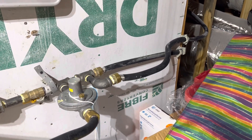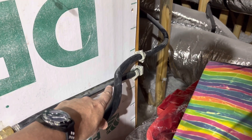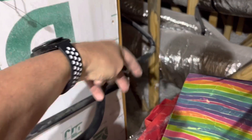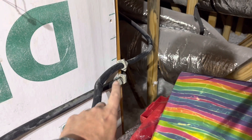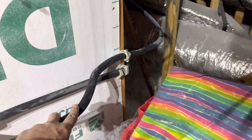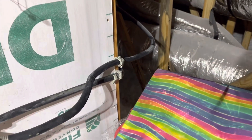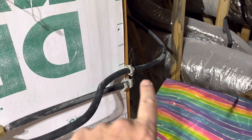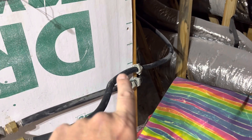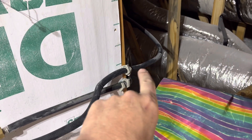That tells me they've got a volume problem. I've traced these two lines to the garage area, then they go into the wall. One of these is the supply line from the gas meter. Now, the gas meter was a three-quarter inch supply — why do we have half inch? Somewhere in the wall, they changed over from a three-quarter steel pipe that came out of the meter, and then in the wall they reduced to half-inch CSST tubing.